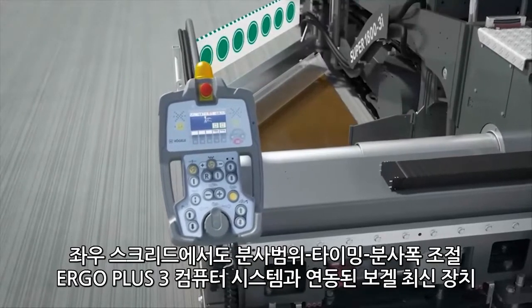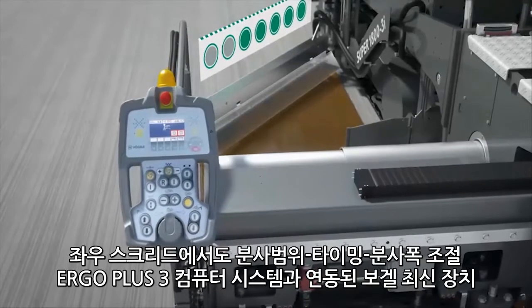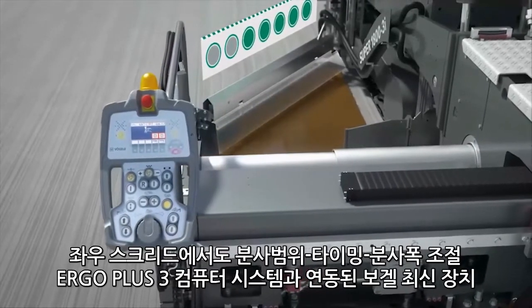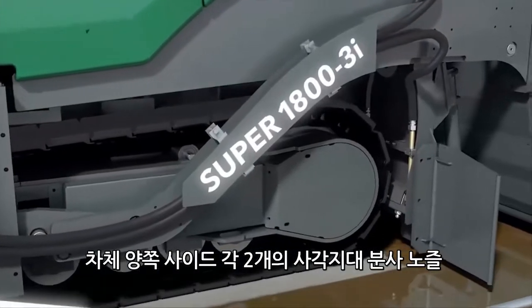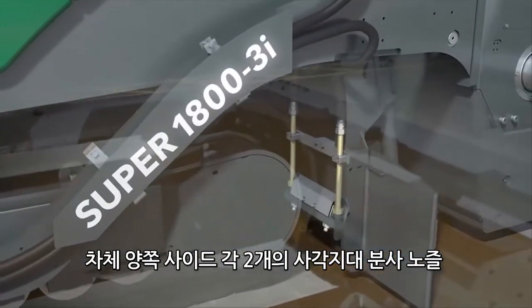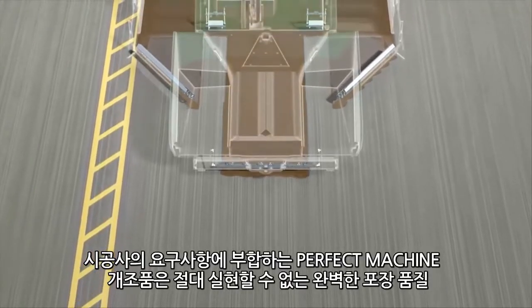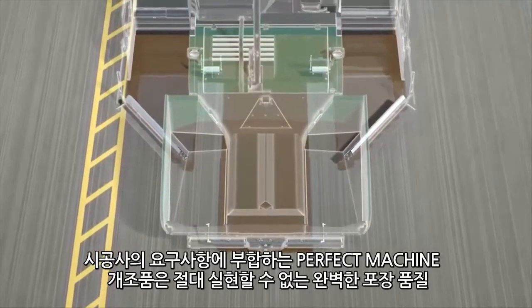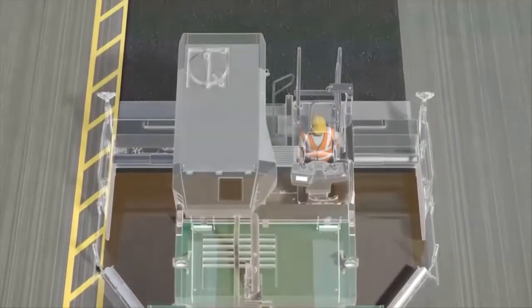The two outermost spray nozzles on the two spray bars at the sides can be switched off at any time, also from the screed console. A further spray bar is mounted behind each of the crawler tracks. Five spray bars ensure complete coverage of the existing surface with emulsion. They are cleverly arranged to ensure that the paver won't drive over the freshly sprayed emulsion.